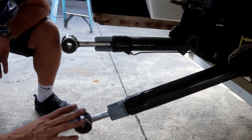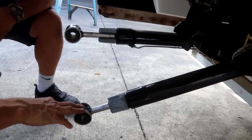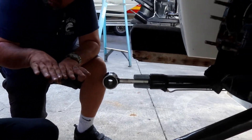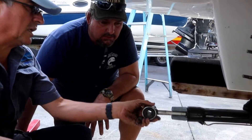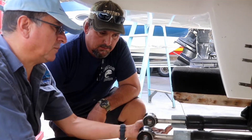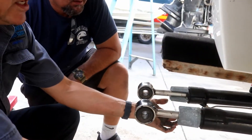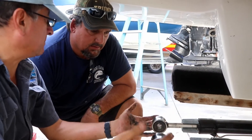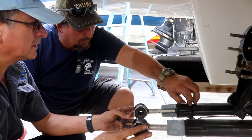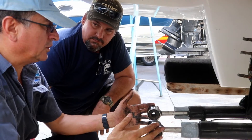Those actuators — to remove the drive, you don't need to remove the actuators. Some people do, but it's easy enough without them. On the Alphas sometimes you need to because they're so close together, but in this case you just open a little and that's it. The only thing to replace is the zincs — there are zincs here and there should be a zinc on the bottom as well. If you have pitting you may need to repair or replace the cylinders.